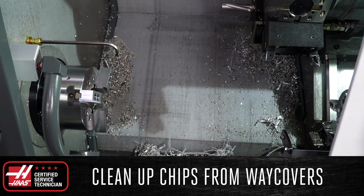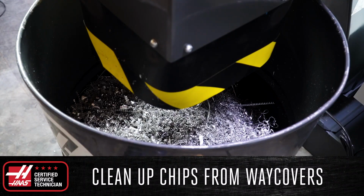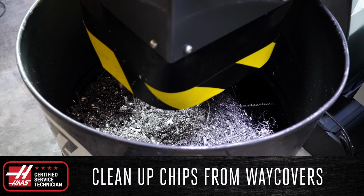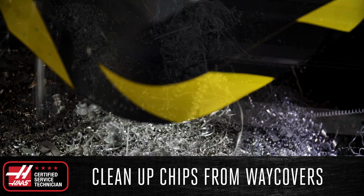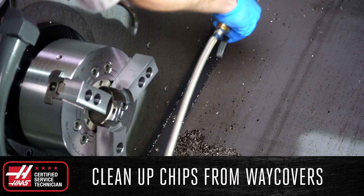After each shift, or at the end of every day, clear off any chips present on the way covers and evacuate them from the machine using the chip conveyor. Use a brush to remove the larger chips and follow up with the air gun to remove the rest. This prevents chips from putting unnecessary strain on the way cover seals, as well as ensures that the ferrous chips, such as steel or cast iron, do not begin to rust within the machine.